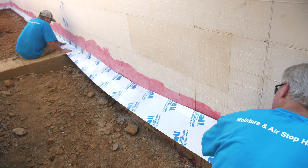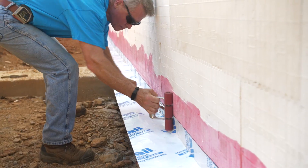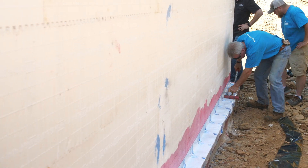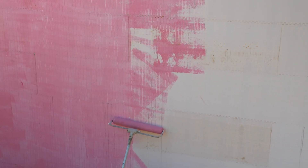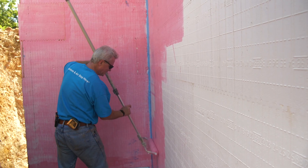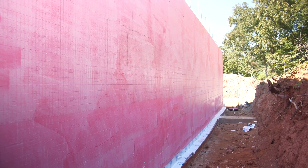We're going to start that detail tape on the wall, go about six to eight inches, drop that down to that cold joint, and do a real good job of getting a nice 90-degree corner there — roll it onto the flat and then onto the face of the footer. That gives us that first critical waterproofing on that joint. Next, we roll the primer onto the main body of the wall. With some pretty tall walls here, this primer is relatively easy to use — you dump it from a five-gallon bucket into a paint roller tray and use a roller with an extension. Once the primer's up, you've got to wait for it to tack up, which took about an hour for us depending on temperature and humidity. Do not omit this step.